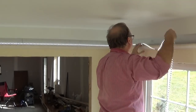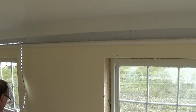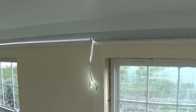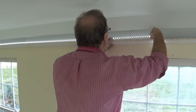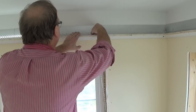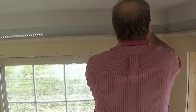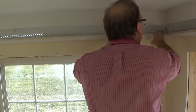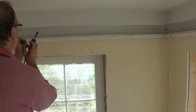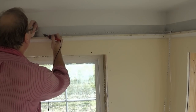I'm positioning them about a half inch from the bottom edge — that's easy to eyeball. As I run these strips I press them down with my fingers, then go back and press again between the LEDs to make sure I get a good bond. I am going to add additional adhesive to address the fact that I don't fully trust them. Here's the end, and I'm getting ready to splice in the next one. I tried the little mechanical splices and I'm not a big fan — they were more trouble than they're worth. So I got my soldering iron and I prefer solder for connections. I just overlap the splice points on the strips and bridge that point with a little solder on each the positive and negative, and the LEDs will be electrically continuous.